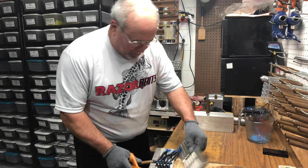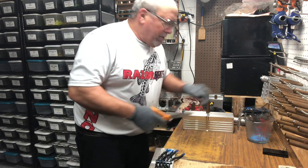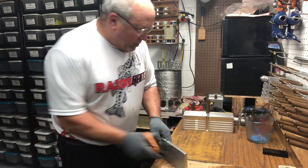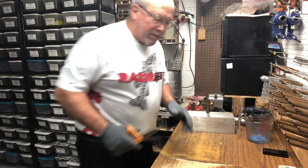With the six molds at a time, you don't get enough time when you're doing a whole bunch of stuff. You don't get enough time to go back and top off the molds. So with the shrink down that you have, you end up getting a lot of air in the runner, and sometimes it goes into the head of the baits.